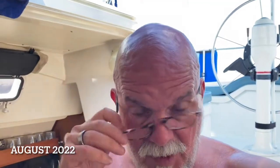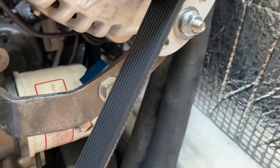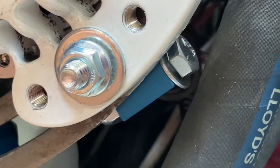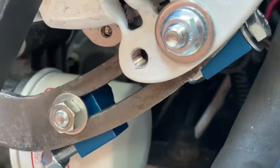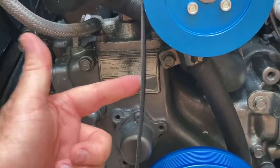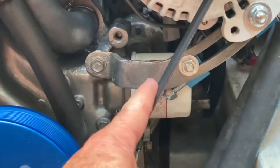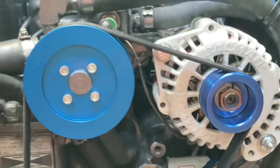I'm adding to this video a little part towards the end. I realized after installing the system that I wasn't able to really get the proper tension on it. So I had to add one little device, also from Balmar, that's made all the difference in the world. You may see it under the alternator — it's basically a bolting system attached to the alternator that allows me, with just twisting one single bolt, to tension the whole thing properly. Now the tension is just right and the belt doesn't wobble as much anymore. You can see there's only just a little bit of deflection — I was able to tension it perfectly.